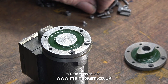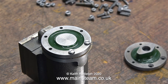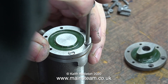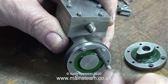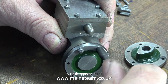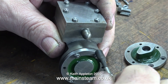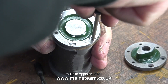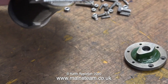In each of the cylinder covers two of the holes are countersunk, and this part of the cylinder cover is hidden behind the bracket. Yet another top tip — never tighten all the parts up until you've fitted all the bolts or studs, and then tighten them up together. Just in case you're wondering, I have modified this cylinder slightly — I wanted my engine to be a bit different. I still have to do a bit of shaping on the cylinder cover, and of course trim the gasket because it's slightly too big.